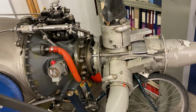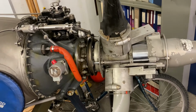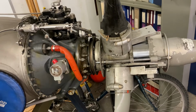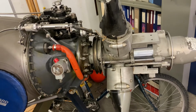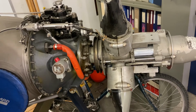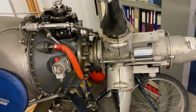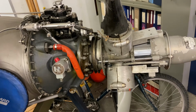The pilot then selects more reverse, pulling the beta valve in. The beta ring will have to come ahead, and as the pilot consciously selects reverse, they can select anywhere from the prime blade, which is usually about 11 degrees, all the way back to full reverse, which is probably around -11 degrees. And that's how this unit works.